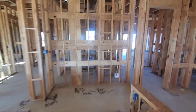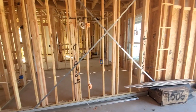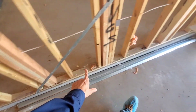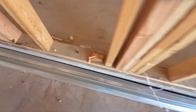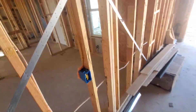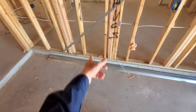Moving inside the house here. Looks pretty good overall — few odds and ends. We'll start here in the garage. This bracing here, these two straps in the form of an X, tells me that this is a shear wall. Any shear wall is supposed to be anchored to the concrete slab, just as an exterior wall would be — that would be proper anchor bolts. You've got some shot pins every three feet or so, but not quite enough. Pretty much everywhere on the interior shear walls, you don't have proper anchorage. They need to add some more shot pins or some proper bolts.